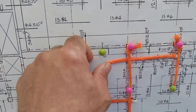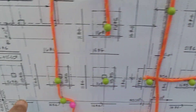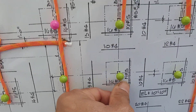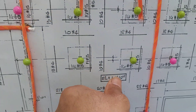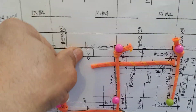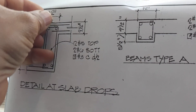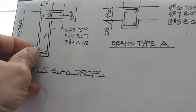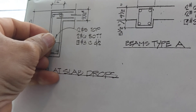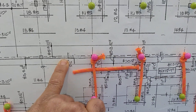I'm going to get you from this pool deck into the structure by talking about the old school elevations. The two-foot-six inch elevation we had here — remember they changed the deck from 10'10" to 11'10", that went up one foot. This part of the deck was going to be at a two-foot-six elevation, but when they brought it to 11'10" they reduced that to one-foot-six inches. That means this was supposed to be two-foot-six — basically a beam in there. They changed the elevation by one foot, making that beam go from two-foot-six down to a scrawny one-foot-six.